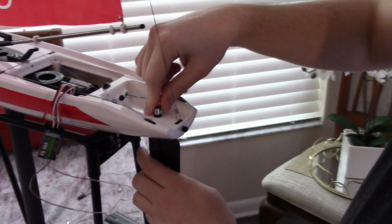Now, something I noticed is that rudder post doesn't come up very far, so you have to make sure you push up and it's as far up as you can get it when you tighten that part down to the rudder post. I'm gonna loosen this first. It may actually, at some point, we may want to shave it down a little bit so it slides up just a hair more. All right, pushing as hard as I can down on there while pushing up. Almost like jamming it in there, but you're not actually jamming it. You're getting it seated to easily tighten it.